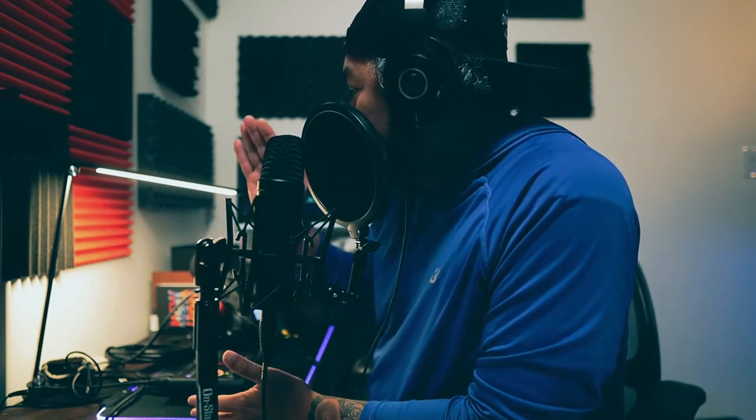So we're running the ART Tube MP Studio going into the Zoom H6 — this is the unprocessed version. What you want to do is let this device warm up for maybe five to ten minutes, since it's a tube. It's like warming up before a sport — old school technology, that's how it works. Since this provides a lot of gain, I cranked my H6 gain down from six to almost two. The tube amp handles the gain and sends the output to the H6.